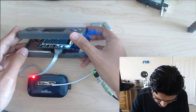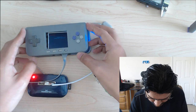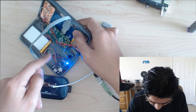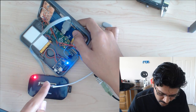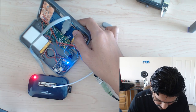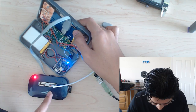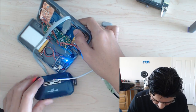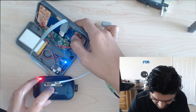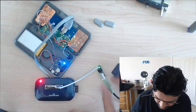The project was fully enclosed, and all the screws were nice and closed up, but I've had to take it apart because this massive USB jack is in the back there. So you can see that's where it is. I have a little USB OTG adapter, which is just this bare minimum little piece of metal that converts a micro USB into a male USB A plug, and I have a hub into that. Ideally, we're going to solder these wires straight into the USB OTG adapter so that it's the slimmest thing, because there's not a lot of space in here, guys, and this thing is probably just barely going to fit.